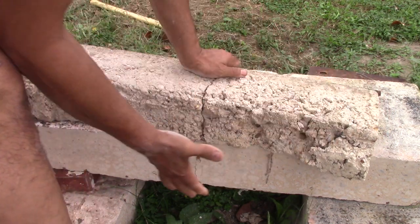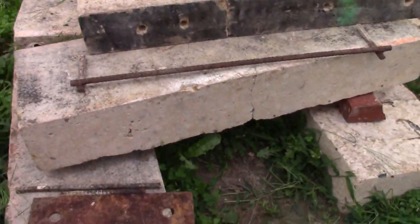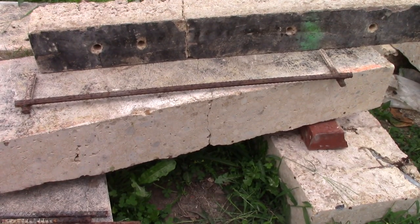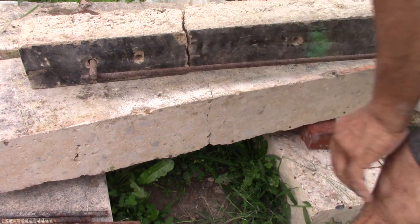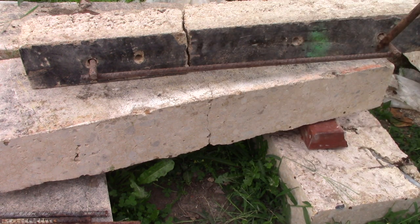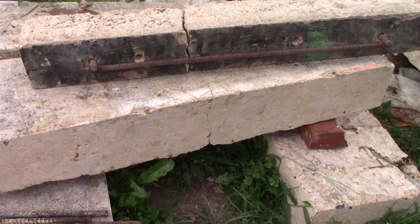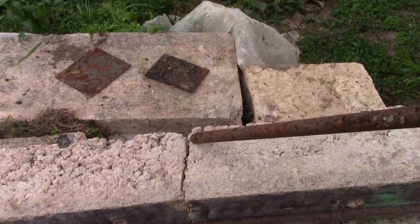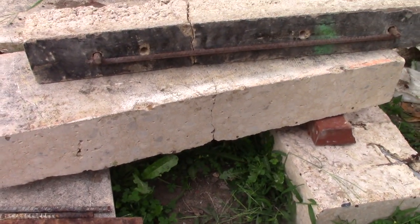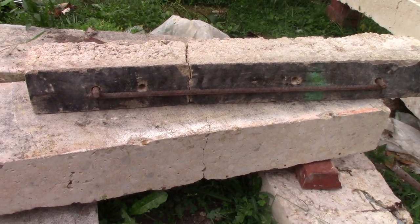So, considering I'm going to load it from this side, this will be the loaded side. I take my staple, as I call it, just so you understand it. You can imagine that as rebar, as that post-tension bar, a lot of different techniques. And I place it inside there. So then I epoxy that in inside these holes here. Let's see if you can see it. Yeah, so it would be that whole epoxy and epoxy. Now I would still epoxy this. The top seam would still get epoxy in it, so it bonds it and it won't have a cycling issue. You don't want this to cycle. You don't want it to flex and keep loading under your deck.